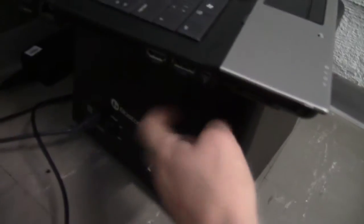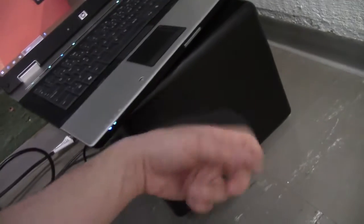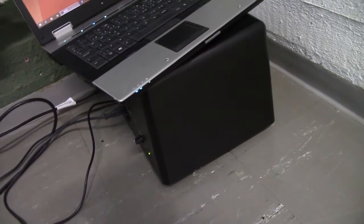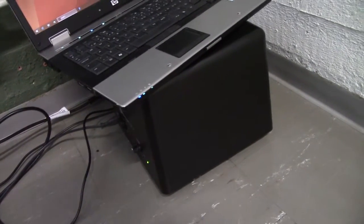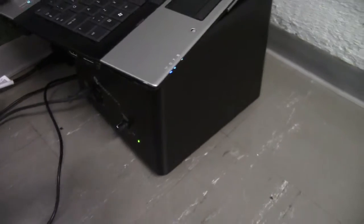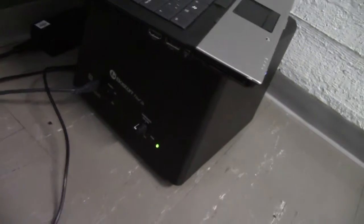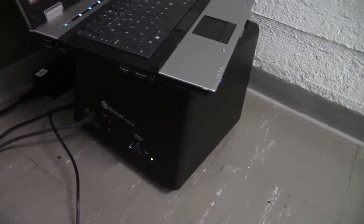There's the subwoofer that belongs to the soundbar. It's a bit weird, it's entirely plastic, very resonant, but in my sincere opinion it actually sounds quite good. It seems to have a very low pass filter on it. It doesn't seem to kick in anywhere close to 100 Hz, so these resonances really don't seem to matter, since that's far well above 80 Hz. And the green LED means that it's wirelessly coupled to the unit, because as you can see, it's only got a power cord. And that's a very, very nice feature in my mind. Not the most high fidelity option, but hey, who cares, it's a cheap subwoofer.